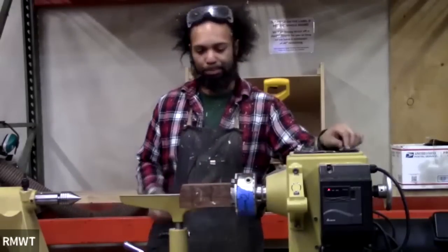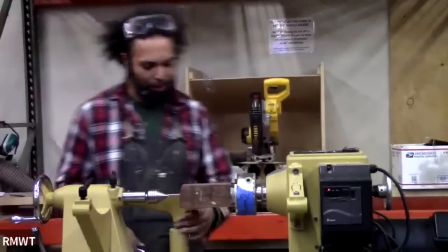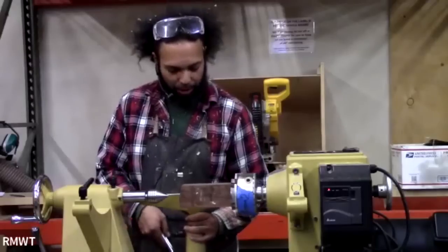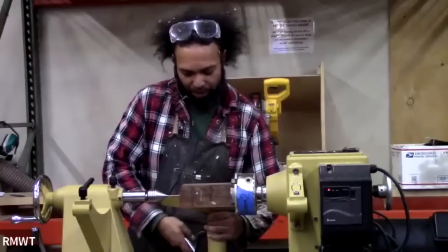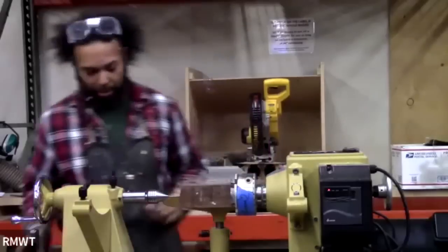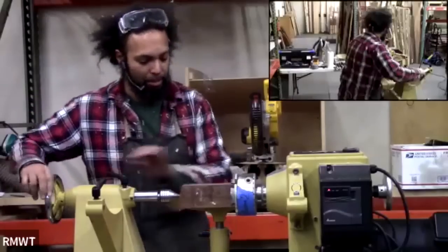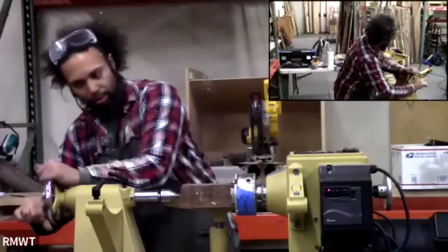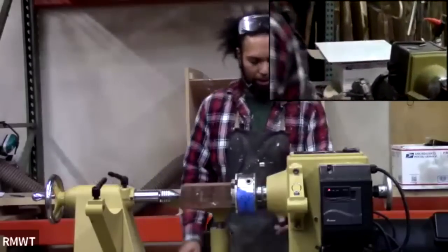So what that then is to say, tailstock support in this case. I am going to rough it down with the skew. Again, you might see other tools over there, but they're not really there because it's the skew we're going to use. And I don't mind having a bit of a gap over here, just for the sake of being able to rough this down, roughly. Didn't mean to make a pun. But just enough to be able to then put a tenon on here, turn it around, and really we're going to zoom through it. And here we go.